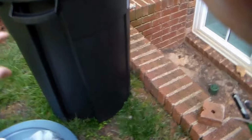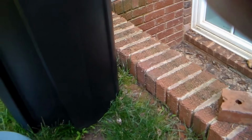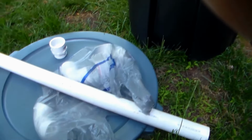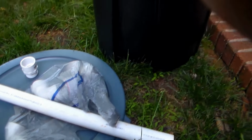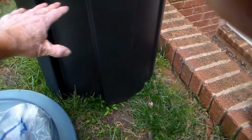Right. Use a 32-gallon trash can, which is super strong. This is the same material as the sump liner is made out of. And we'll use the lid, which is super strong also. You can step on it, won't fall through or anything. And that way we'll cut this off to whatever level we need, we'll cut it off right here, and that'll bring it up to grade.